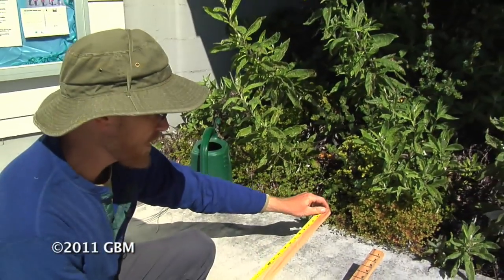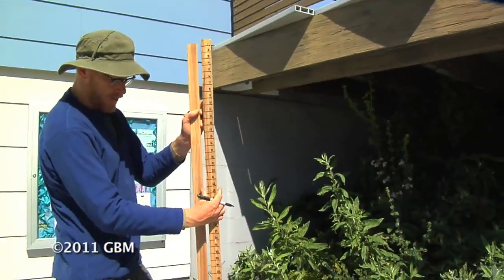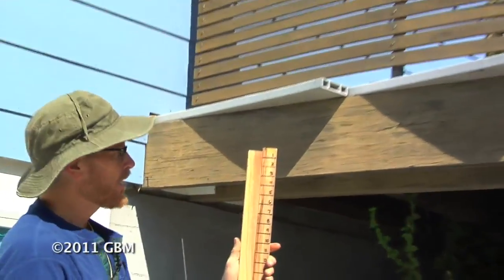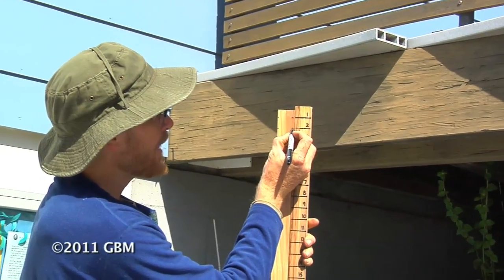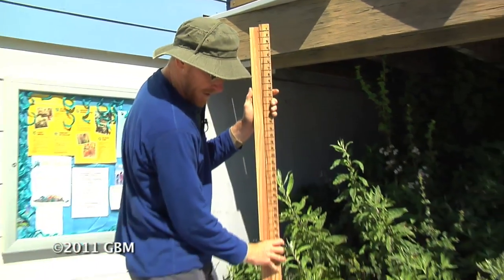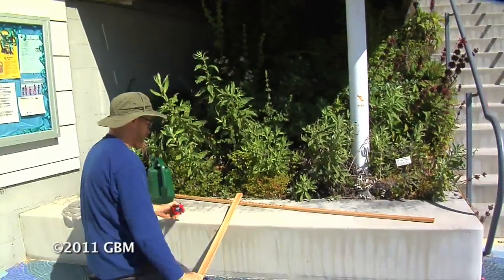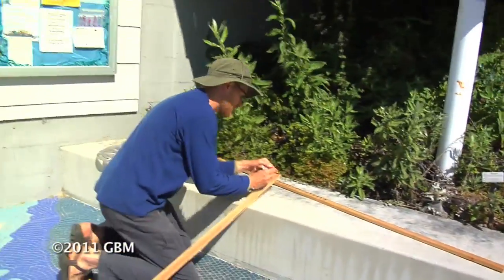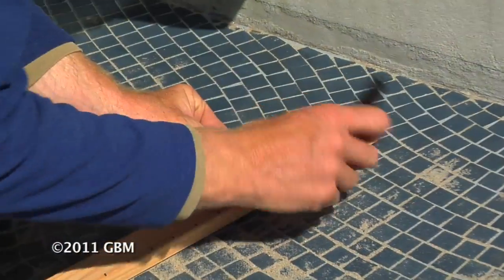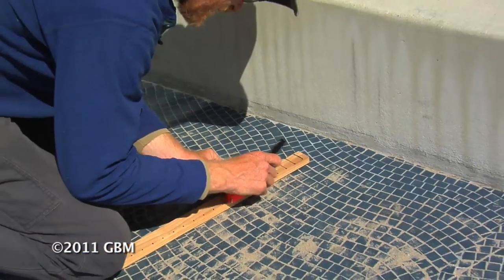I do not want to start measuring with one at the top on this stake because there are different heights. If you see, I hold these up to one another — this one's slightly bigger than that one. That's fine, as long as we make the lines of measurement the same on each, once we've got them sitting on level ground. Now I'm just going to take the tape measure and use it as a straight edge. If you had a speed square, that would be even more exact, but this works fine.